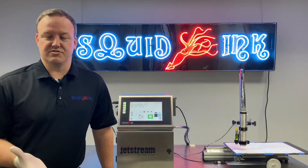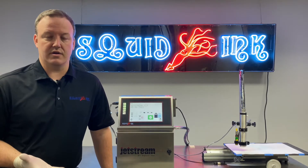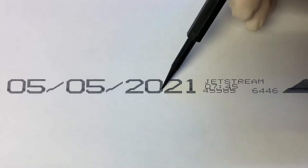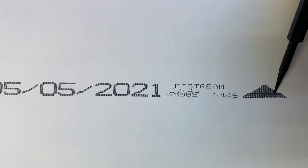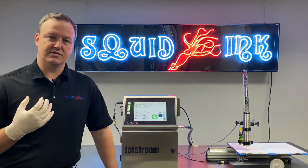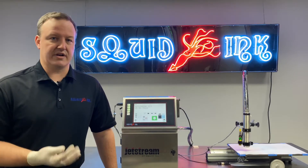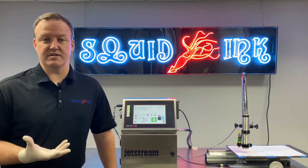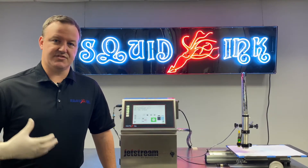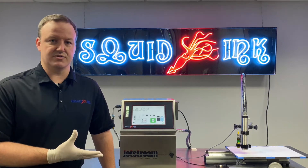If we're calibrating our modulation value, typically the scenario or symptom causing us to do this is poor print quality. We're going to include some photos of different scenarios in which we have poor print relative to incorrect modulation. You might be wondering why would my modulation need to be changed if it came from the factory calibrated a specific way. In this scenario, sometimes the printer might be a few years old — it might take a little bit more voltage to drive our gun body to break our inkjet up into droplets where we need it to. As the system ages, as the gun body ages, we just might need to recalibrate this slightly. It's not common, but this is just a video to explain and show you how to do that.